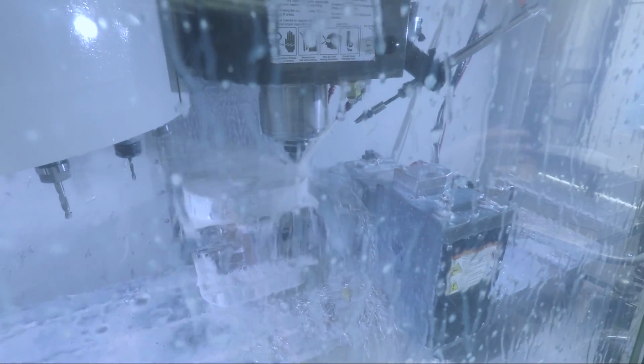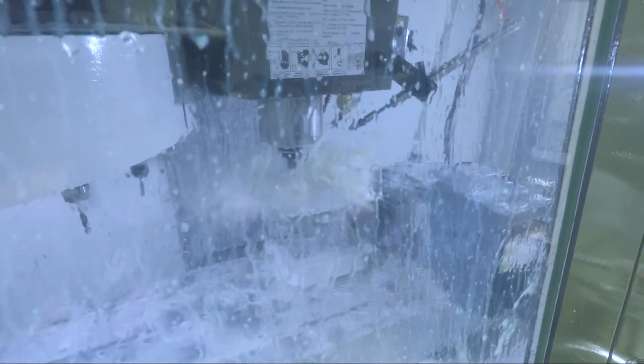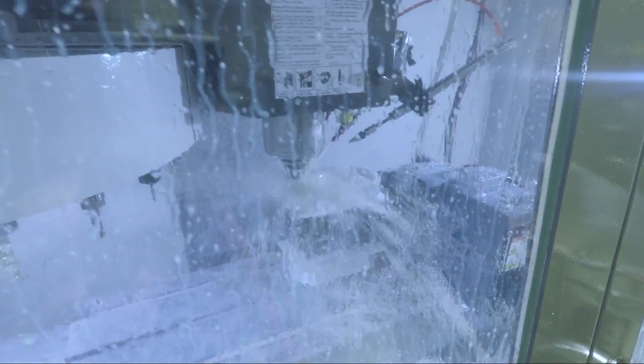And we're also interpolating that hole that we drilled so that our reamer can follow it. It can be centered. It's a good little trick, folks. If you're ever doing a reamed hole, give yourself a 50 thou or 100 thou blown out diameter to start a pin when you go to press it. That way you're not fighting it from the surface. Usually it won't affect overall functionality of the pressed pin. All drills will walk, and then there's runout in drills. So by interpolating that, it gives it a perfect starting place for the reamer.